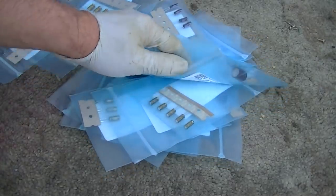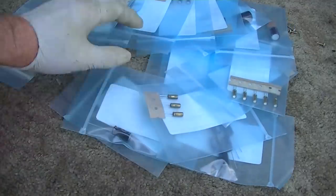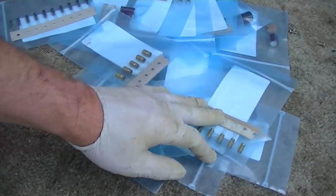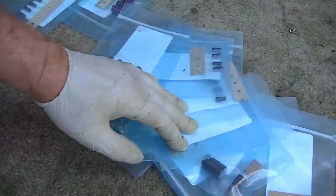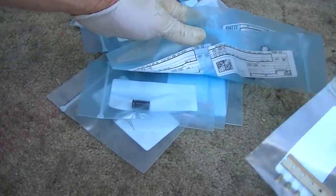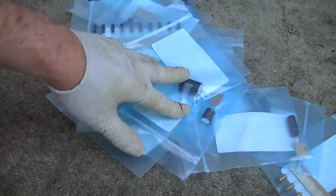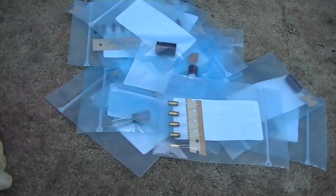And I will say that I didn't spend a whole lot of time selecting capacitors. I selected them more based on the ripple current and the price and availability and the popularity of sales than I did really sit down and do my research. So that's why we got gold ones and red ones and purple ones and brown ones and black ones, but they're all Nichicon. Some of them might be audio grade, some of them might be automotive grade, some of them might just be generic filter and bypass, but they should all be decent caps. The main goal of this video is just to get this TV to work right. I really doubt I'm going to use this TV. It's kind of pointless to have one of these TVs today anyway with the analog over-the-air signals gone. It's more of a novelty than anything.